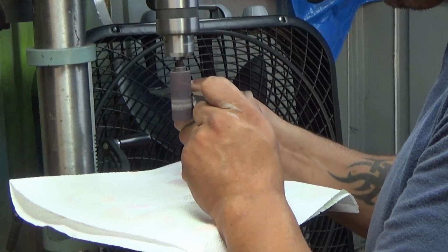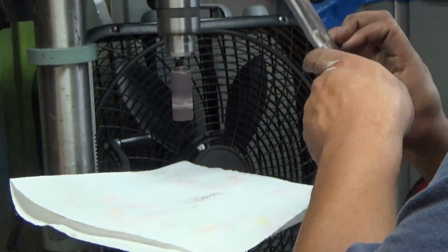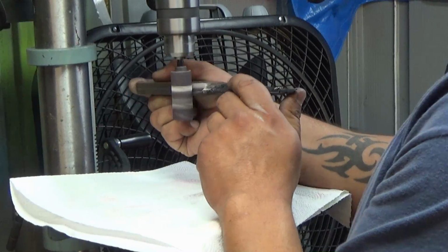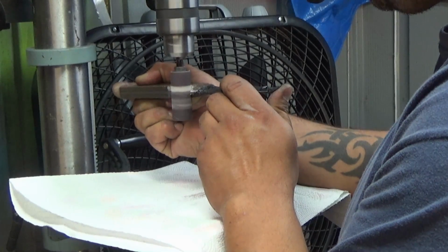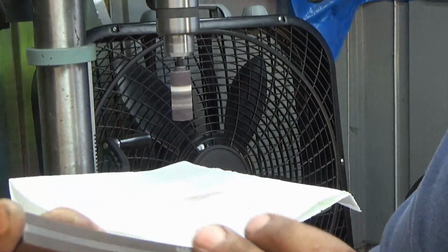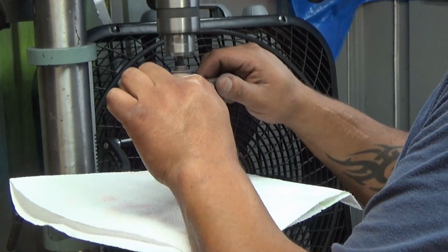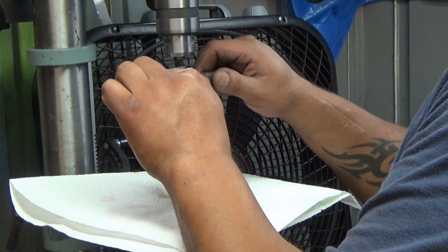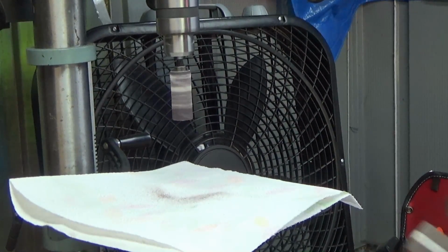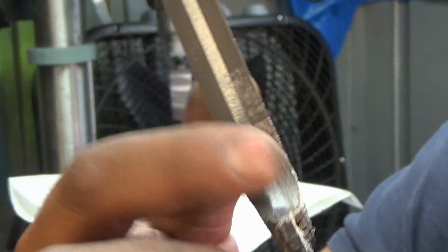You'll find that these drums wear out pretty quickly. You don't want to go with, like I said, crazy pressure or anything, just cleaning up scratches. That's why we did most of the work with the file. It's getting there, still some work to do in there. Clean it up here and get rid of those scratches, because I slipped with the file earlier, so now we have to clean that up too.